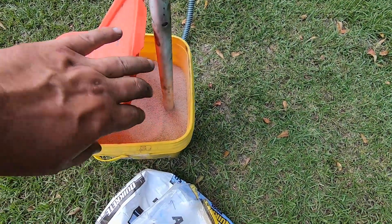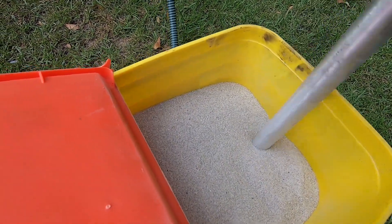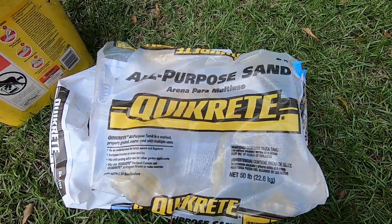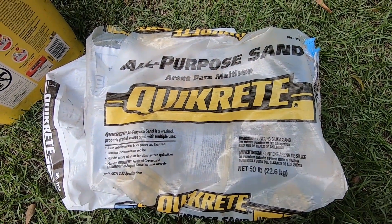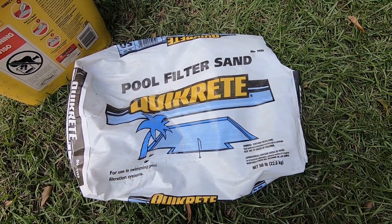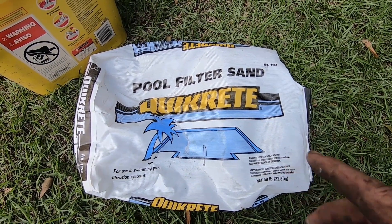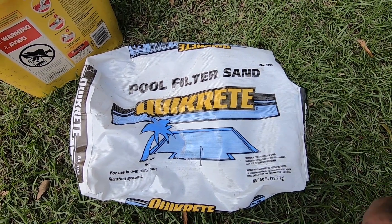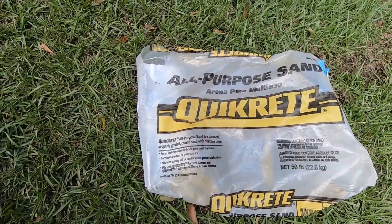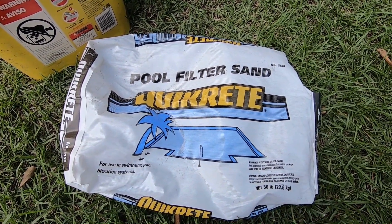A little bit about the media we're using — this is just a bucket with my sand in it. This is the probe; we just stick it down in the bottom and it sucks out of the bottom of the bucket and does a good job. When I first started I was using QuikCrete all-purpose sand picked up at my local Lowe's, and honestly it didn't work very well — it was just too fine. Doing some research, I switched over to pool filter sand, also made by QuikCrete, and this stuff really does the trick. It's a little bit coarser sand with sharper corners and it takes stuff off really well. This bag was about $3.50 a bag while the pool filter sand is about $7 or $8 a bag — a little bit more money, but well worth it.